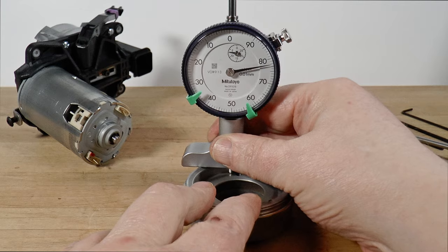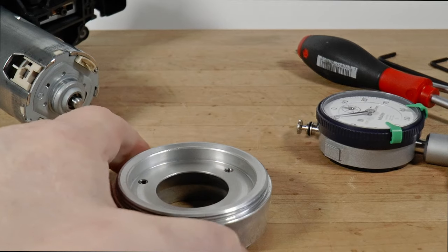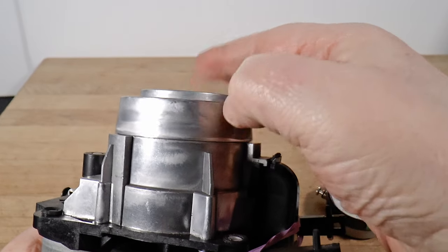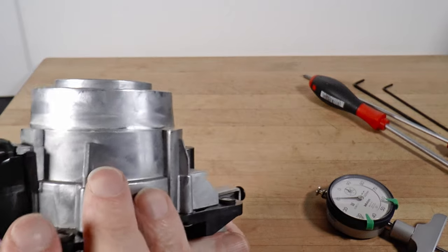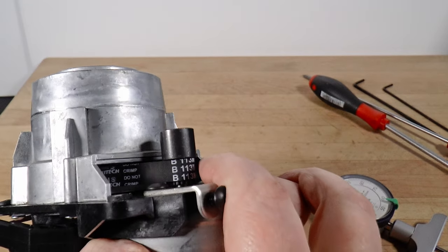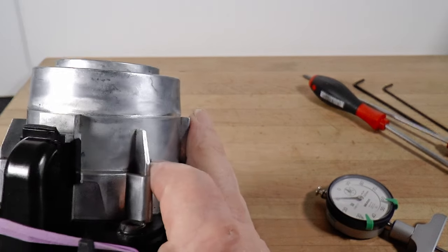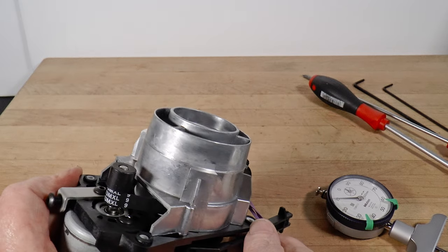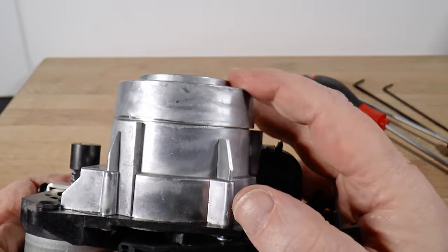There's a good amount of thread lash here, which in this case is a great thing — it means there's enough play that the two halves can meet squarely, machined surface to machined surface. You can see there's pretty flush contact all the way around. Most importantly, the quality of the ground coffee tells me that the burrs are nicely aligned and stay nicely aligned under load, because if they didn't the coffee would show signs of that. I'm pretty comfortable saying that the burr mounting surfaces are parallel to each other to an enviable degree, and normal belt tension doesn't appear to be a factor.